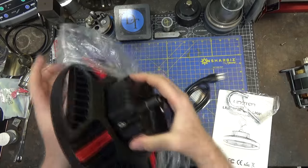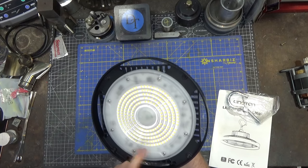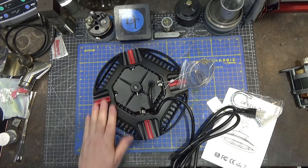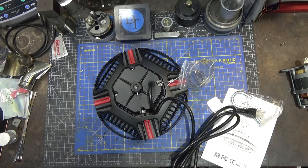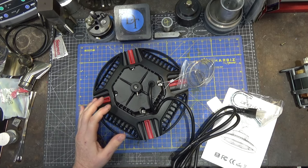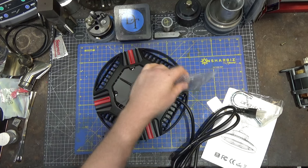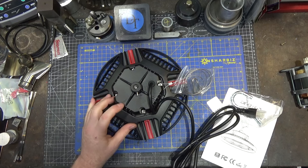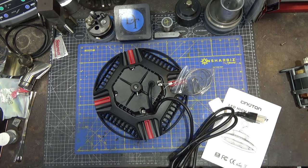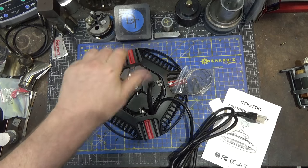The whole back of this thing is cast aluminum, and the bezel with a Fresnel-like lens is plastic. It's an array of LEDs — very nice. I like the fact this is all cast aluminum; that makes for very good cooling capability. There should be a switching supply back here, a constant current supply to feed the LEDs. Remember, LEDs don't want a specific voltage — they want a specific current. I also noticed they have a safety chain, which is very nice. The casting is decent quality, and the mounting hook style makes it very easy to move around if needed.